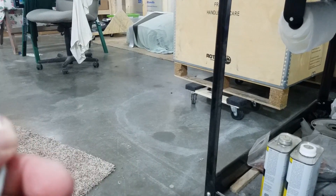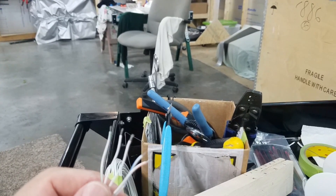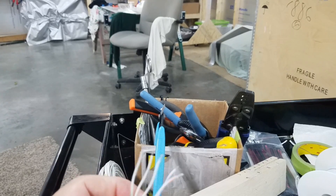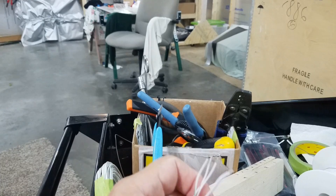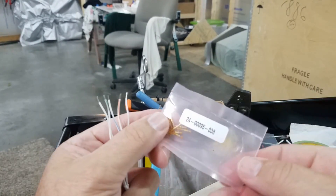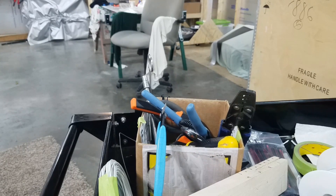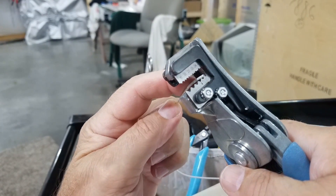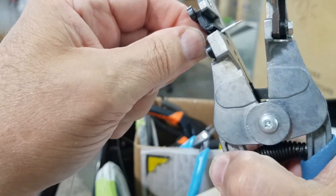Your Vertical Power comes with a number of boxes with a number of wires. I have this 5-wire non-shielded wire left over, so I thought — why not use that for the switches? That'll save me a lot of trouble when routing the wires. I have about 10 switches, so two of these will about take care of all my switches. This one uses male pins. I've already got a strip, but I want to go through one complete wire-in with you. You put it through here and gauge it for your ends. After you do about a hundred of these, you won't have to have your gauge anymore — you simply strip it off like that.